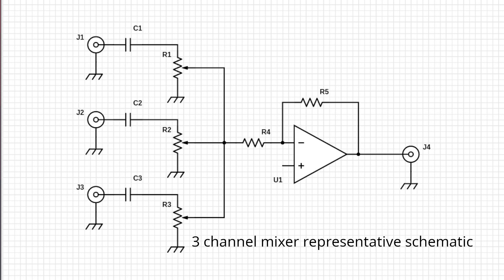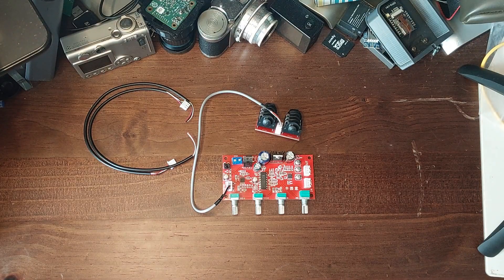You can even make it without the amplifier — just with a set of resistors and pots. But in most cases you'll have a set of little pre-amplifiers, then a set of variable resistors, and a little amplifier. I made one like this when I was a student — very, very simple. It used a BC-109 or similar transistor and three or four pots, all taken from old television sets. It really was a nasty piece of equipment, but it did work. A little mono mixer.